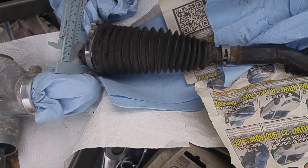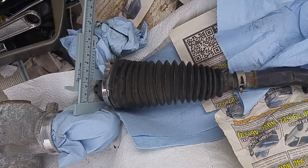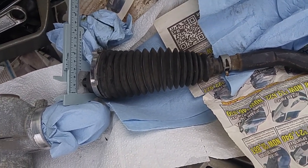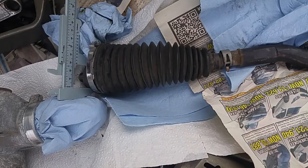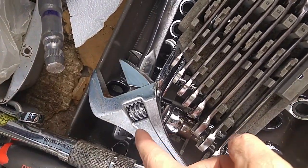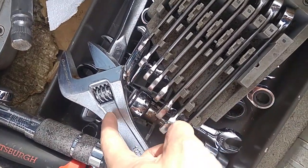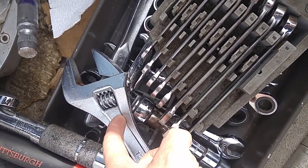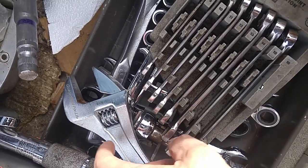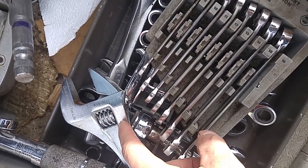That got me thinking — when I was looking at the kit, those little pieces are sort of like a crow's foot, and they're calling it a crow's foot, but they're not the crow's foot with the 3/8" female square socket interface. So I'm thinking, these are $21. I can get one of these 12-inch ones for $21 and EDM a 3/8" or 1/2" square socket interface onto it.